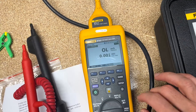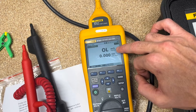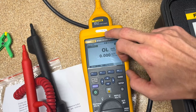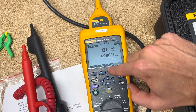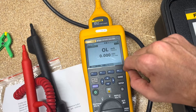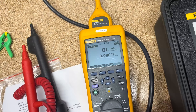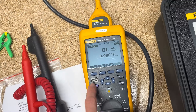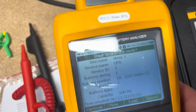We're going to start by turning the unit on. You can see we've got both our impedance reading and voltage right here on the screen. We've got it set up for auto save. To set up a string of batteries, you want to hit the Meter/Sequence button right here, and that jumps us into the setup menu.